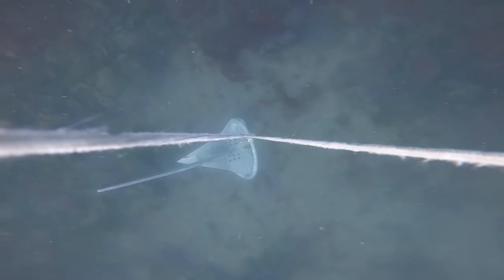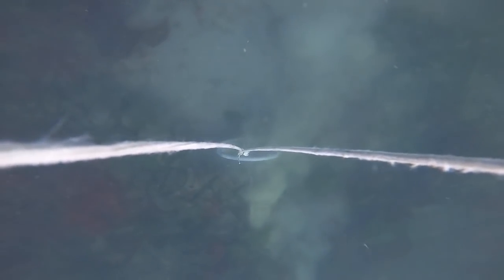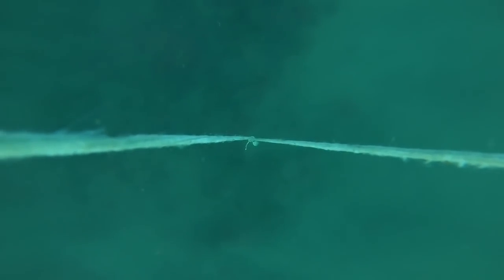Okay, we're back at the sandy mud site, and this is the deep set test. Initial set is perfect. Once again, I've edited out all of the lower power thrust settings. We're just looking at the maximum thrust, 680 pounds. This is where it always suffered. After just a short period, it would take off dragging, but now the problem has been solved. The anchor is fully buried. I don't see any part of it. And it holds the boat solid as a rock.